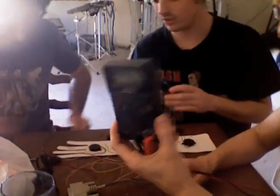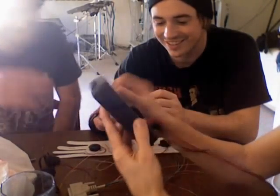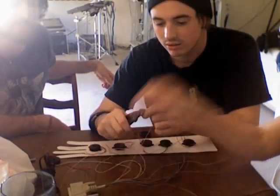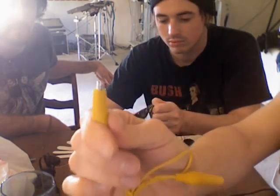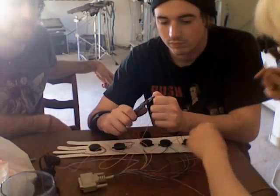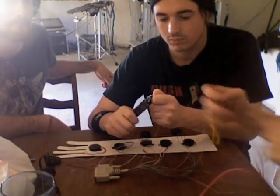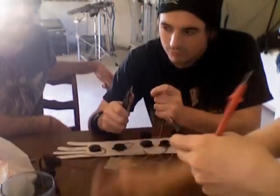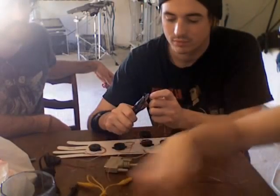Cody can continue stripping. Everything I own is from Radio Shack — it's all very affordable and it works. We're going to put this on ohms, because that's how you can tell if the wire is connecting from end to end, if you're completing the circuit. So what we do is take one of these handy clip wires — it's got a clip on both ends — clip it on one of the stripped wires, then clip this onto one of the two cables that comes off of the multimeter.